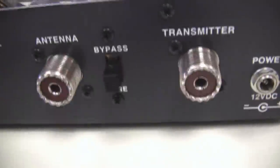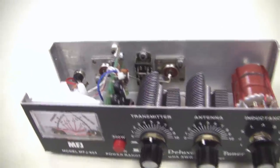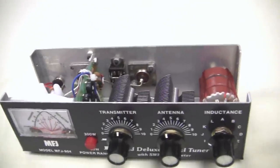Tie this to your antenna. You can bypass the tuner here if you wish. Tie this to the transmitter. And if you want to light the meter, here. That's very basic. Like I said, this is intended for use in portable operation. I've used this particular tuner myself. It does a fine job. It's a very basic tuner, but it's small and you can carry it with you on expeditions, providing you're not running more than 300 watts and you keep the SWR low.